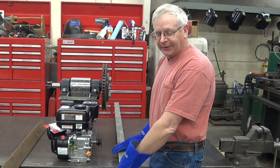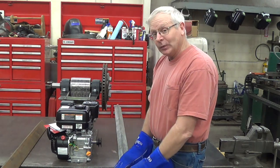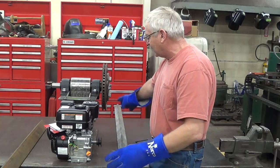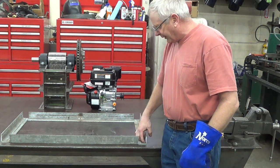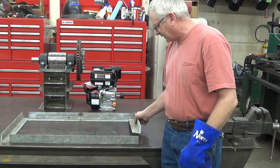I found this piece of angle iron — it's galvanized. I'm not super happy about that but I believe it'll work. We'll make a frame. I've looked this up and measured it a bit. What I'm going to do is take these to the iron worker and notch out a corner so we can weld up a seam here, and these will actually fit together like this.